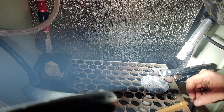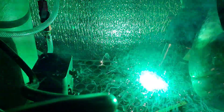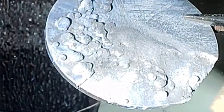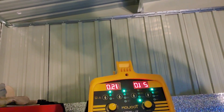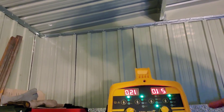I'm going to try and actually do a little weld onto it. Nice! This is perfect for the aluminum. 15 feed — you could go down to 14 if you want. 21 volts — you could go down to 20 if you want.